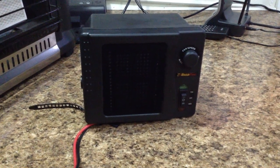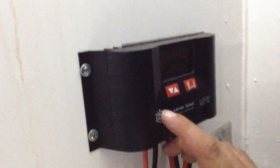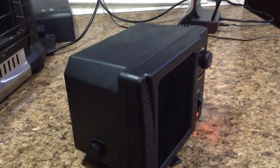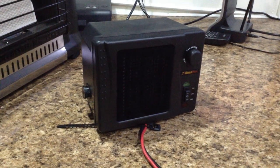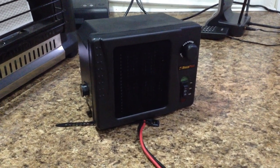What I can say is that if I'm just hanging out for the evening and getting ready to go to bed, this thing is going to be fine without really costing me any money because I've got solar power for free. Looking at my battery drawdown right here — I've got 13.1 volts right now, and when I turn this thing on it drops to 12.8, but it doesn't even drop much. That's mainly because I've got four pretty large deep-cycle batteries on this system that were fully charged when I came here tonight to do this test. I think this is a good item — it is what it is. They're under $50, available on Amazon.